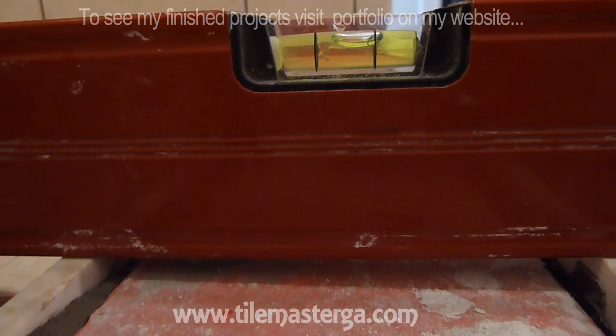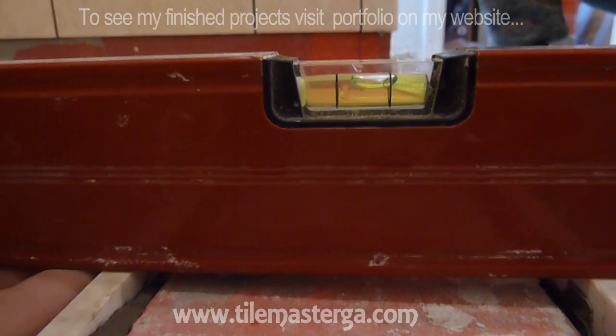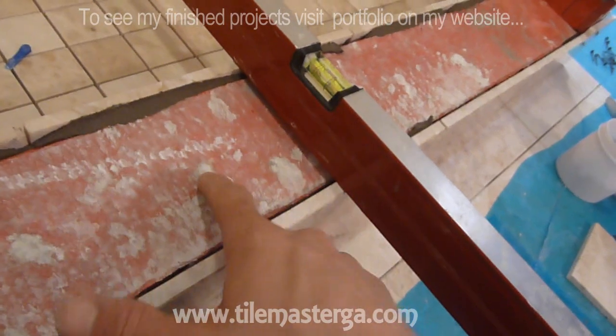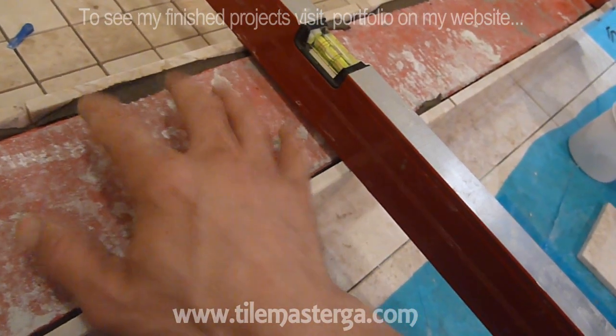This is level, we have this slightly uneven, so the tiles angle to the inside of the shower. And another step here, we have some space, so what I'm doing, I'm filling this space with thinset. We have RedGard with a fiberglass mesh tape already here, so nothing will happen to the curb.